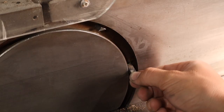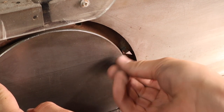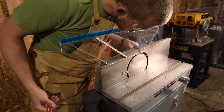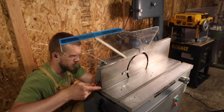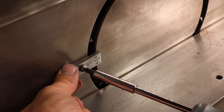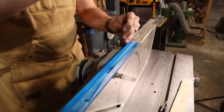After sharpening, you put them straight back in, making sure you get them in the correct orientation. Push them in far enough so they don't interface with the sole as you rotate the cutter head around. Once all cutter heads are inserted, there is a small threaded hole in the left-hand side of the cutter head area on the outfeed fence. You'll use the screw and depth gauge from earlier, putting it in with the rough side facing in first — it has 'rough' marked on the outside so it's easy. Then from the back of the Uniplane, gently push each cutter forward and use an extended allen wrench through holes in the webbed components of the outfeed fence to tighten the set screw to the right depth. Once done with the rough cutters, do the same for the fine cutter heads, which sit about two thousandths of an inch further out. After all cutters are installed, do one more pass to ensure they're tight from the top set screw location.